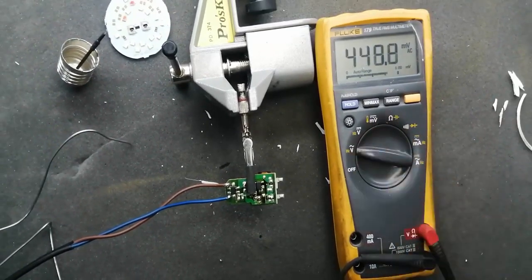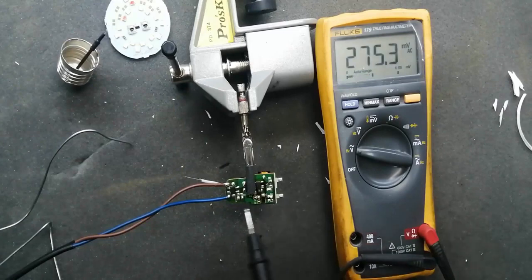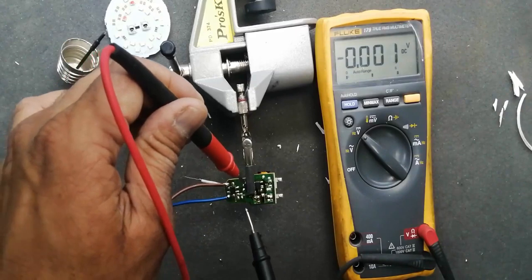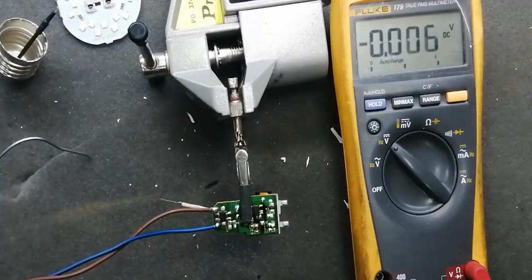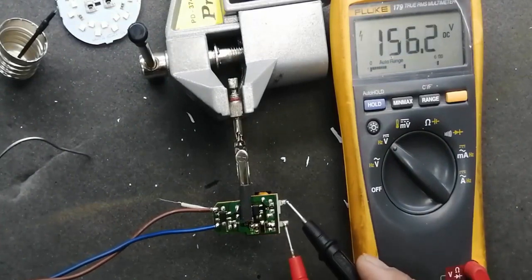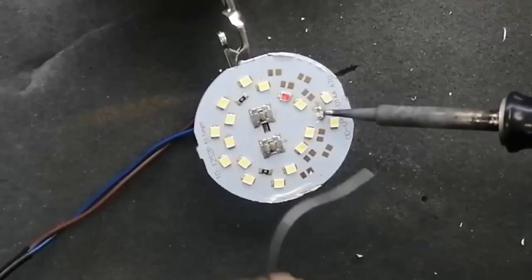I will show you: set AC voltage and check it at the input terminal — it is 231 volt. After that there is a DC stage, a rectifier, at the capacitor. At the capacitor it should be 333 volt after rectification; on the capacitor you will find 300 plus volt. At the output with open load it is 155 volt; when we connect the LED terminal it will drop down to about 80 to 100 volt.